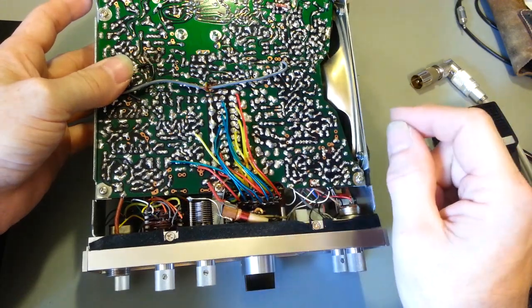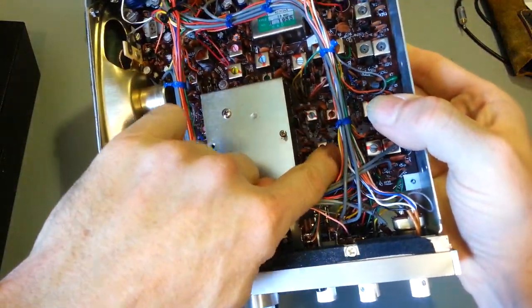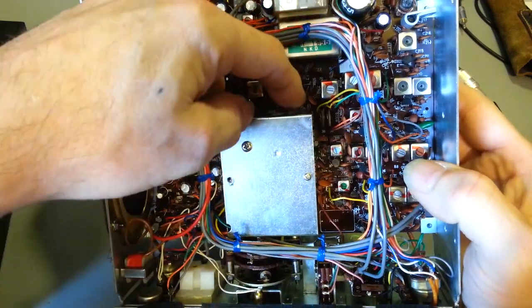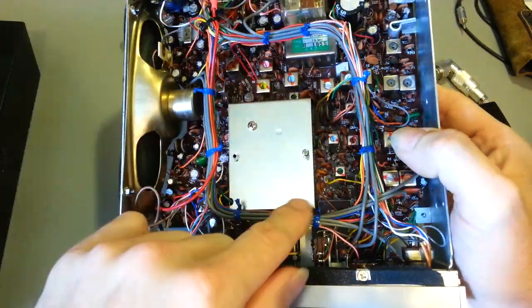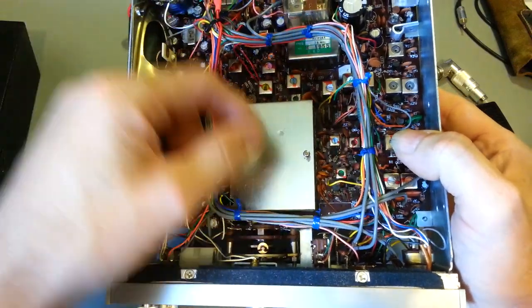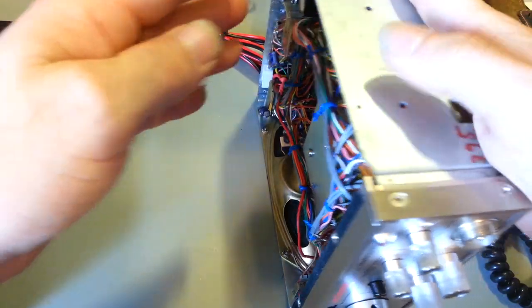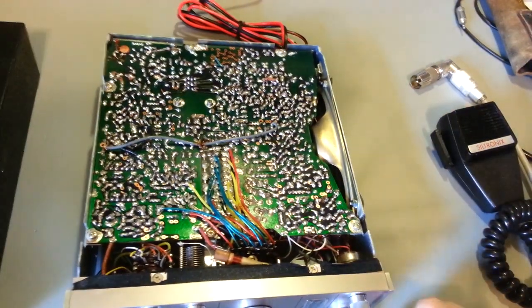and you run into that problem where you're attaching to, there's a test point down here, and actually there's another one down, actually there's a bunch of them. There's another one there, another one back over here. But those are, you're going to be checking for your AM, your upper and lower sideband frequency adjustments. If you cannot get any of those into alignment.